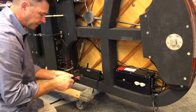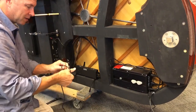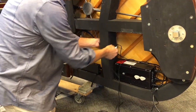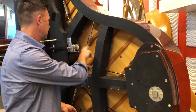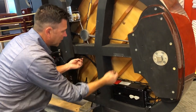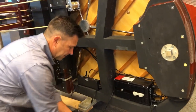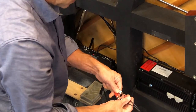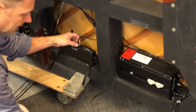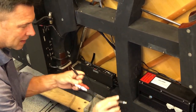For speaker wire we're going to need a speaker. Most pianos you're upgrading already have a speaker, so you just take that speaker — we include barrel connectors if you want to keep the old speaker cable, but I would replace it. You have a one-eighth inch side and an RCA side. I'll probably mount the speaker right here on this Mason & Hamlin, which has a lot of beams, and the cable will run up the inside of the beam to the speaker so we don't see cables. This plugs into number three on the processor. We include a Y adapter for older-type speakers.